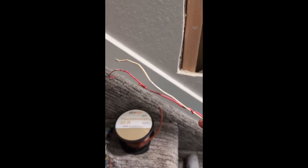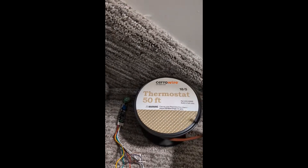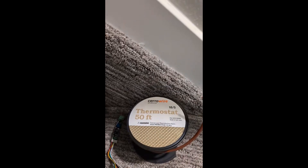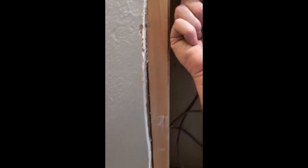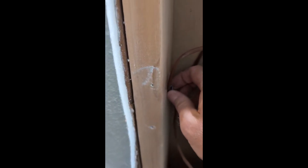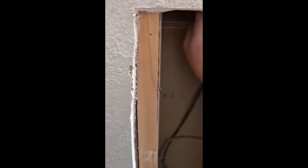I went to Home Depot and bought 18-gauge 5-wire thermostat wire, specifically made for this. I taped it to the end of the two existing wires and pulled and pulled, but it got stuck somewhere in the wall. When I cut the wall open, the wire was right there because a staple was holding it. Luckily I was able to pull the 18-gauge 5-wire through, but the last staple was really tight against the stud. That stupid two-connector wire broke, so I had to cut it out, only to find my 18-5 wire was right there. I just pulled it out and fed it through.